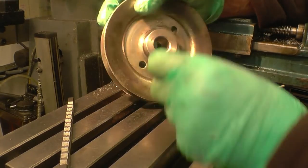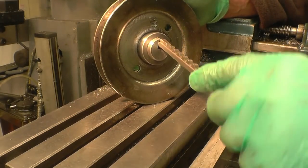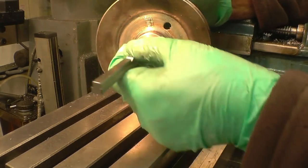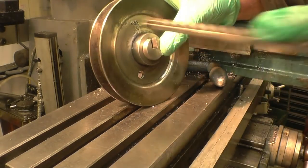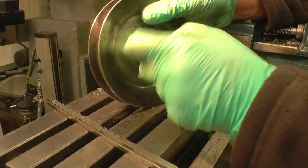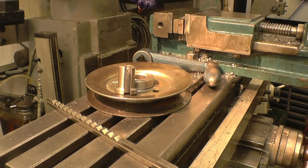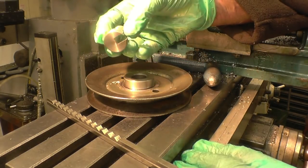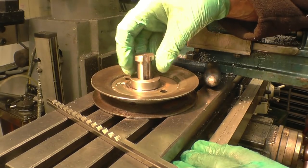I've taken the rags off it — that's a good fit in there. The broach goes in there and you can see it will be starting to cut. It will become crisp up here and we'll start to cut the key there. I've got quite a few of these in different sizes but you never seem to have the one you want anyway.